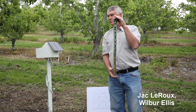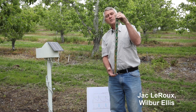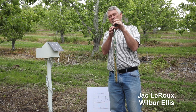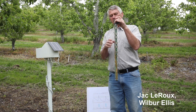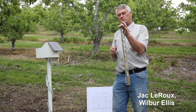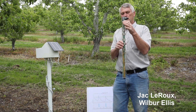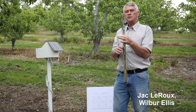In wine grapes, people might put in six-footers and you can get up to 15 sensors. But the beauty is you make one hole, auger it tight, and you're disturbing a minimum of soil. You press it in very deep, and it's designed to be subsurface. This is a see-through version, but the real thing is just gray and fully filled up with resin.